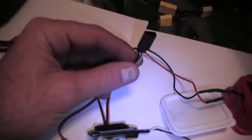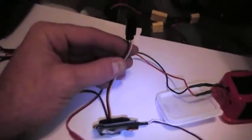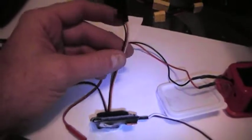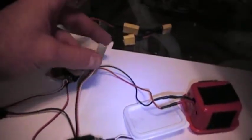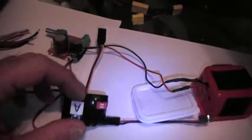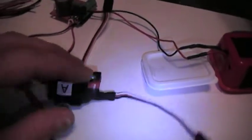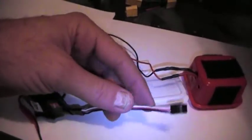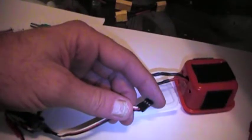If I want to add the gun card, I just simply plug it into the second pigtail lead coming off here, which would normally be attached on a Pro version A or B, but on a budget version it's not. Simply solder this onto any version you've got, and if you put the male mating lead on the gun card and plug it in, now you can add gun sounds. Plug the other end into your aux channel on the receiver — your switch, aux eight, aux seven, whatever you're using, or mix it with a channel.